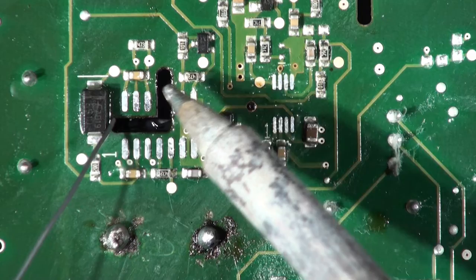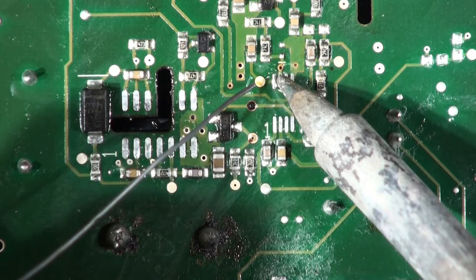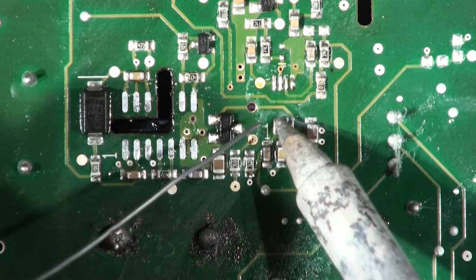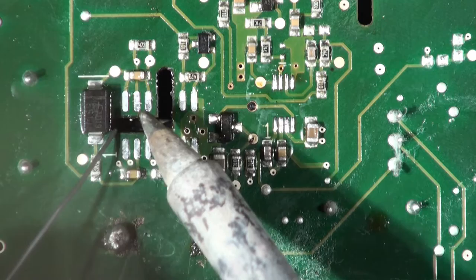This is a Weller 60-watt temperature-controlled soldering iron - very good. There's a heating element up to there and the last bit is just the hot tip, so it's pretty good at regulating. My blower's still pumping out hot air - nothing unusual. I'm applying some solder to these pads for when we reflow the chip back on. We could do a manual solder on that one - I'll show you a manual way some other time. On this one you can but you really need a magnifier.